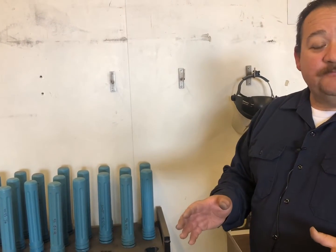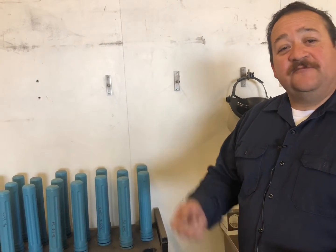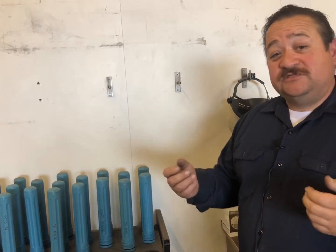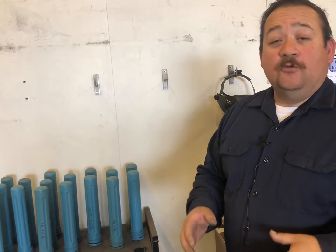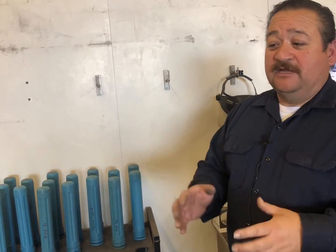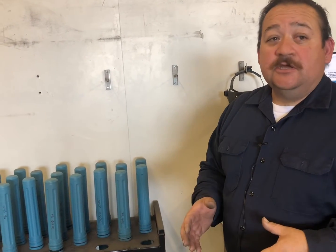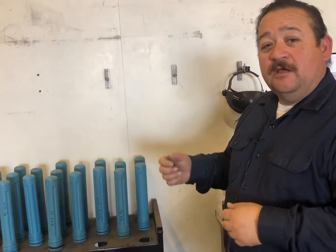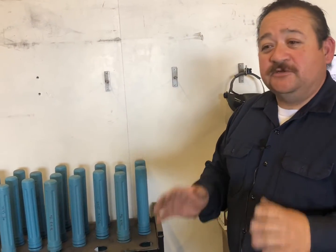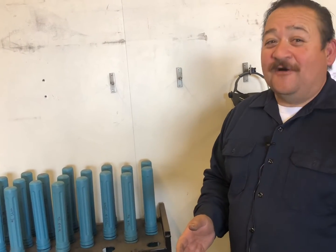I've taken tests where I've noticed that some people will accidentally mix in stainless steel with aluminum because they don't have enough experience to realize the differences in weight between the rods, and because they look so similar, they actually try to dip stainless steel into an aluminum part. And when you're working with flight hardware, or something that is working on some sort of equipment, and you don't clean that out and it fails, you could hurt somebody. So you need to have everything labeled in its place, ready to go, so you can just pick it up and walk away and do your job to the best of your ability to make sure that everybody's safe, everybody gets to go home at the end of the day, and that people don't die or fall out of the air because you messed up because you used the wrong rod.